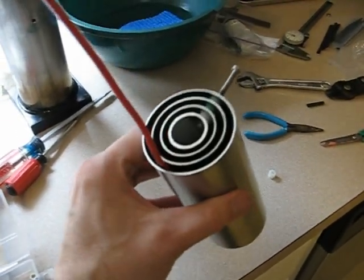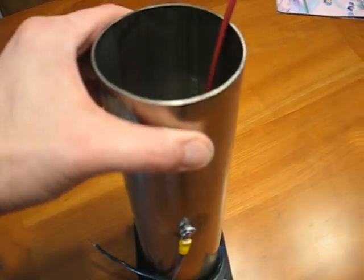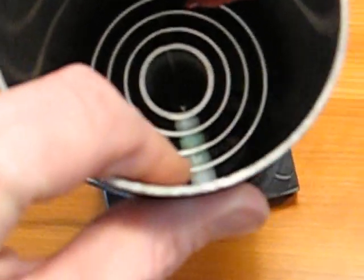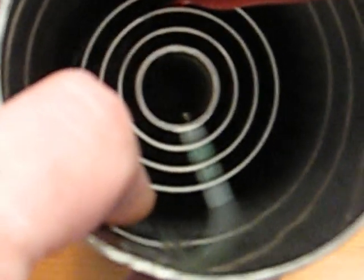After the cell is assembled, it looks like this. I set the cell into the housing — as you can see, though visibility is limited with this lighting. Down in the bottom, I put a little bit of RTV onto the spacer to fix the bottom in place. I put in my first spacer, set the plates in, and push my screw through the first spacer and through the first ring. Then I put in the third and fourth spacers, and finally screw everything in. It's all attached and fixed very firmly — it will not move.